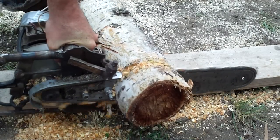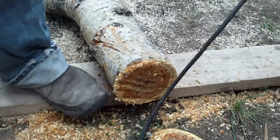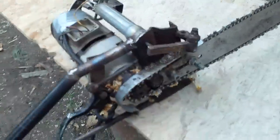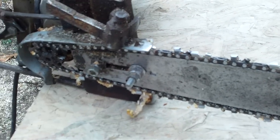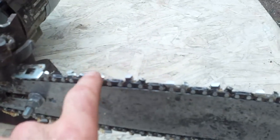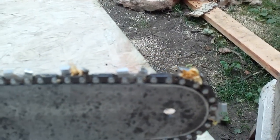So, let's do it. It's not the speediest saw you've ever seen but it works. Ideally you'd want a faster motor, because what happens here is this turns a little bit too slow and the teeth kind of fill up with wood. You can see it's doing it down there and then it doesn't cut very fast anymore.